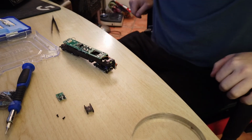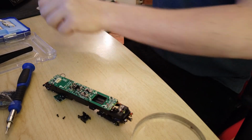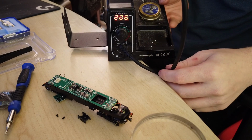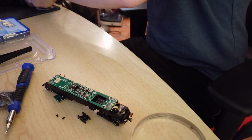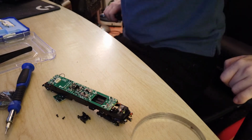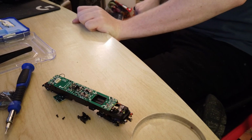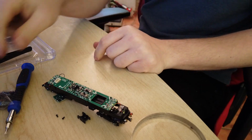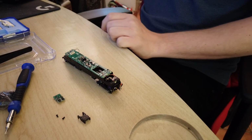Now this is one of those great soldering irons. I'll show you it. That you can select the temperature on. In fact, that was another Amazon purchase, so I'll leave a link in the description below for that one. The beauty of those is you select the temperature. You can do fine electronics like this with a lower temperature, or you can do harsher, bigger wires, bigger soldering jobs with the higher temperatures, and you don't have to have multiple soldering irons. You can tailor it to your needs. And that's been really good for us on this actually.